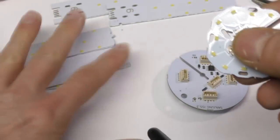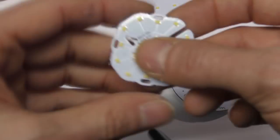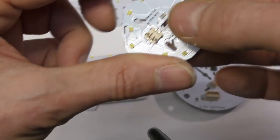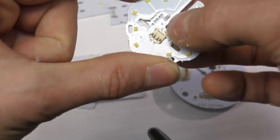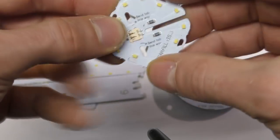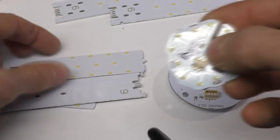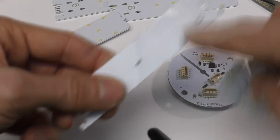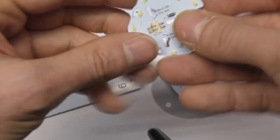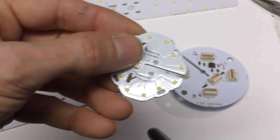I have a feeling that panel went into production before we'd finalised the component values for these LEDs. We knew they'd have to be dimmer, but I don't think we knew exactly how much dimmer. We were still waiting for some more cube samples to be manufactured. So by putting a resistor on here as well, instead of having all the resistance on here, we had that scope to adjust this when we pressed the button on production on these top PCBs.